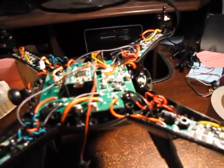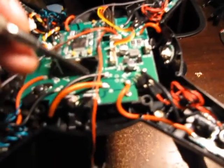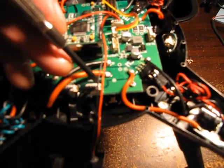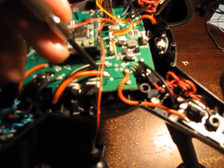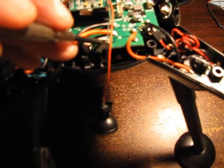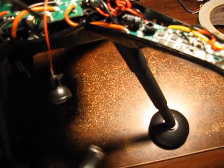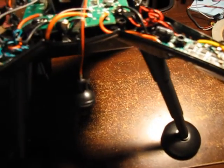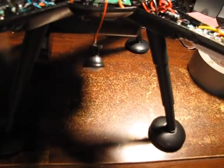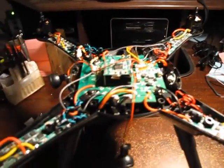Now I'm working on the board. The 12 volts coming out of the board goes to this wire right here, and this wire goes to this run right here, and this run goes to this red cable which is the power in from the battery. So what we're going to do is bypass this little black wire which is 12 volts DC — and the one next to it is the ground — they go down to the plug on the bottom of the quad. We're going to send power and ground to that plug with a larger wire so it can supply power to more than one product, so the gimbals, transmitter, OSD, whatever you might have that plugs into the 12 volts, can get 12 volts without it being much of a problem.